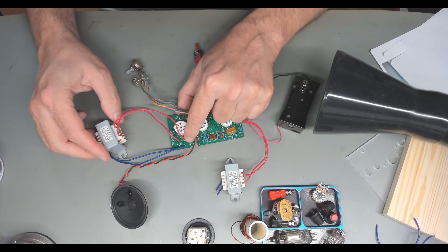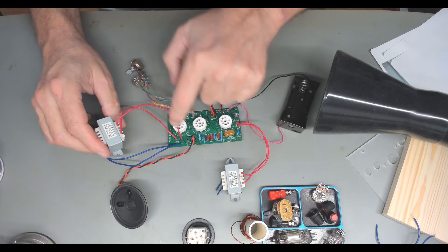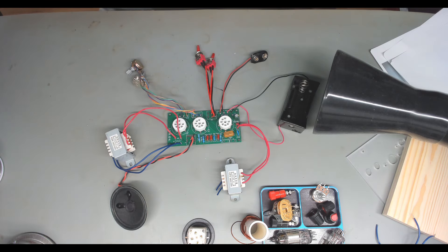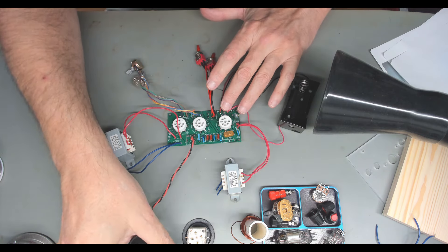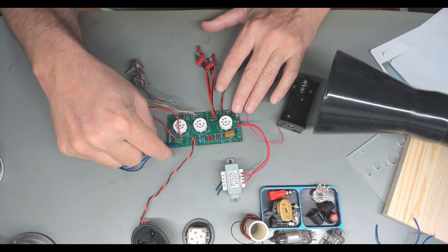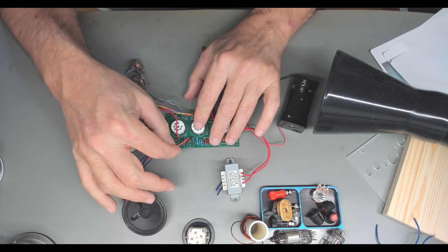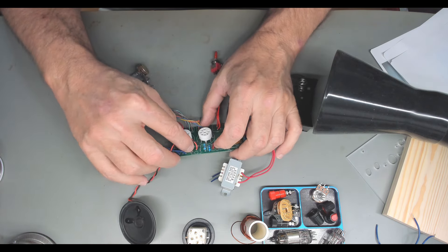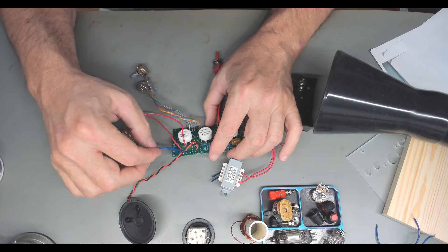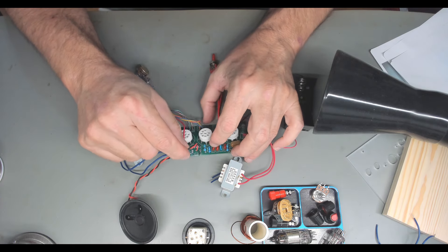When I looked at the second schematic, it's marked 220 coming in here. The board has markings showing 220 this side, 6-volt this side. So 220 in that side, 6-volt in that side. This is your impedance transformer for your speaker. I didn't see where they gave a place to hook the speaker — it all comes back off the 6-volt to this earphone plug. I traced it out and found the center lug here is one side, and the two corners are the other, so I went ahead and wired to that.